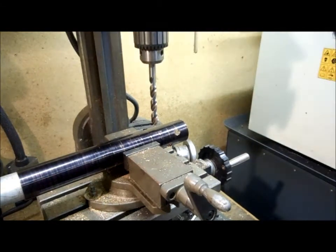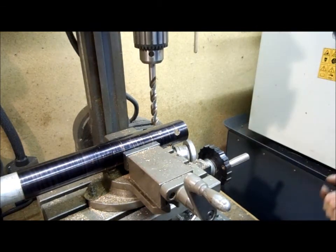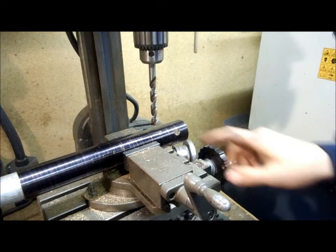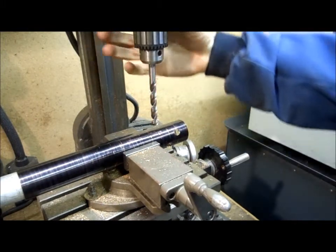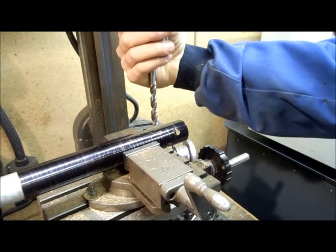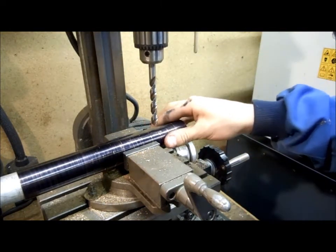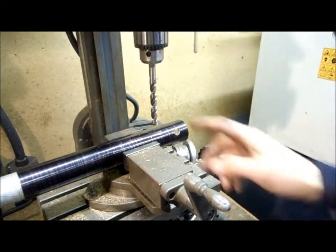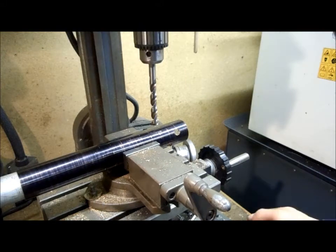I've set it up in my mill. It's not a very big mill so it does struggle a bit. I have to run it at high speed to stop the motor overloading — it's not ideal because it screams a bit. It's quite hard drilling. Now I'm drilling it 9mm, and the finish size needs to be 9.6mm, so I will ream it to that. Also the tubes will be splayed or swaged in place, so that will take up any discrepancies. I'll demonstrate the drilling of one of the holes — they are a bugger to drill, especially with the equipment I have.